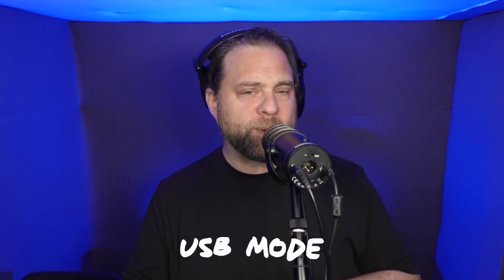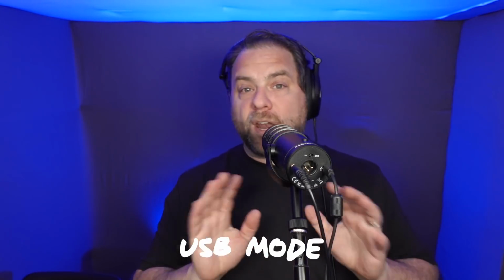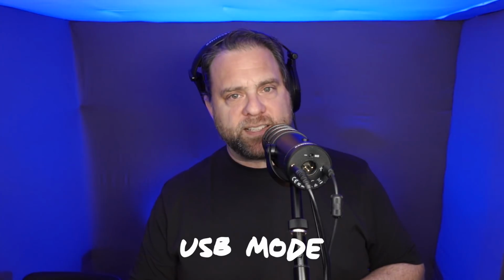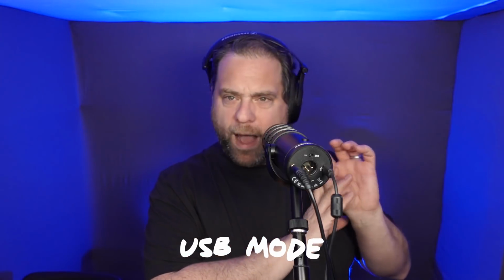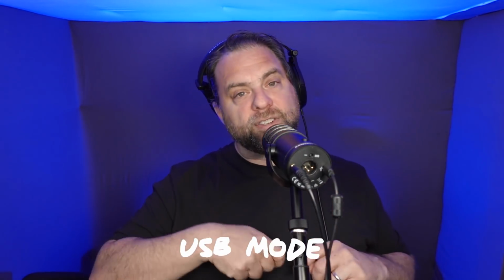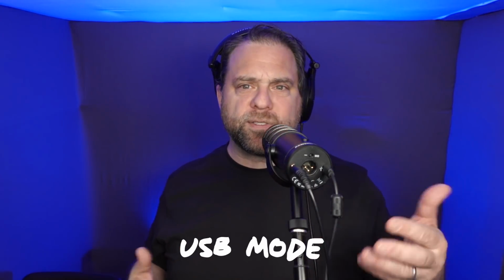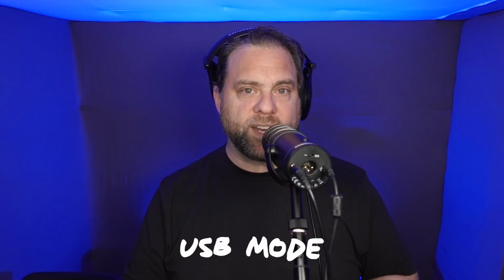It's not important for me from a testing perspective, but you should at least know about that click as you're using it. But other than that, the microphone comes with all the connectivity you need in order to make this microphone work with a computer. As I said, I was not able to connect this directly to a phone. You would need to maybe use a powered hub, or you could use an XLR to a powered USB interface and have that interface connect to your phone. So if you wanted to use this for something like Clubhouse, if that was going to be important to you, you would need probably some additional connectivity.